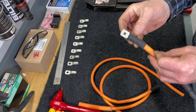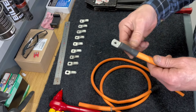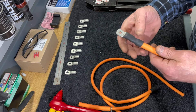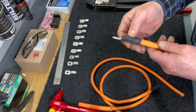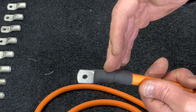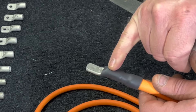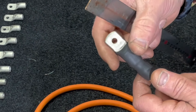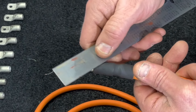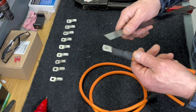You might wonder why I'm doing it like this rather than having it higher up. It's always a trade-off — it would be easier to put it a little higher, but I'm trying to protect this as much as possible since we have high voltage here. I want the cable shoe as protected as possible, so I'm pulling it as close to the terminal as I can, and then I'll shave off any part of the shrink tube that interferes with the terminal itself.